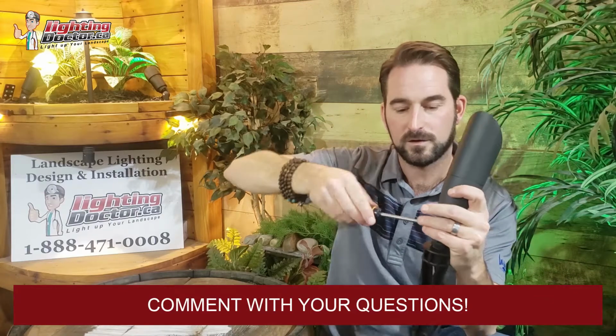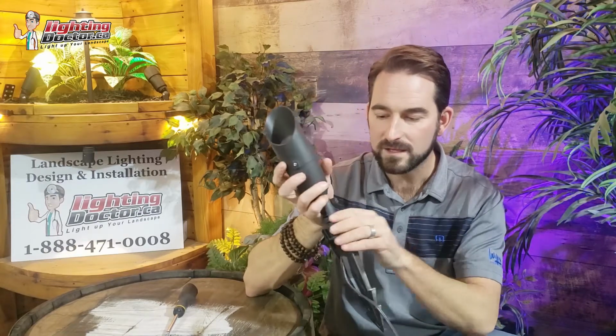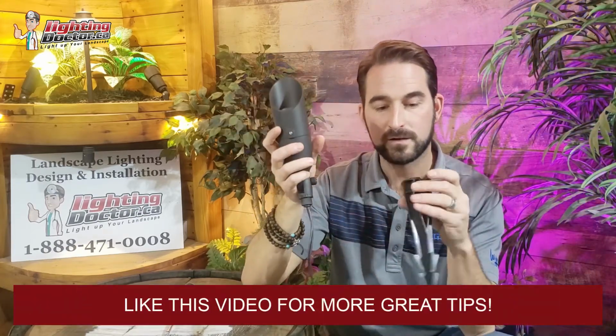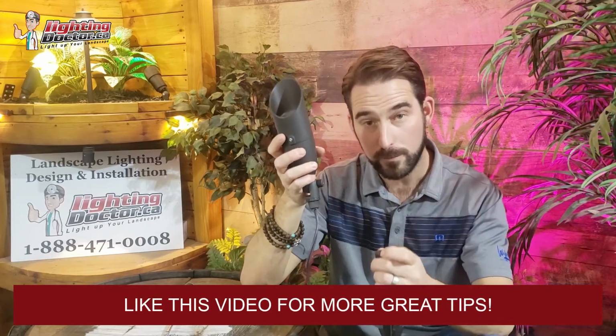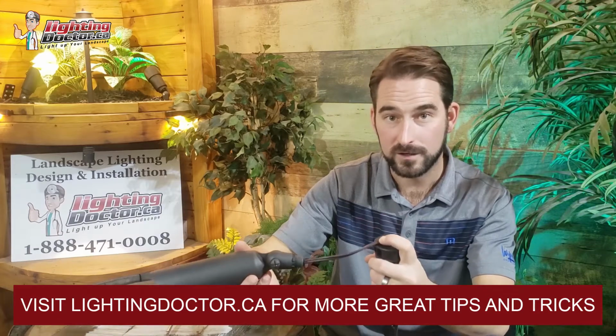The other thing is the ground stake is not quite as durable as with the RS uplight, but it does have the slot there, which we like, so that you can just slide the wire in and out. Why that's important when you're installing it is that instead of some fixtures where you actually have to feed the wire through before you pound it in the ground, this one you can pound in the ground first, and then you can slide your light in and then screw it in. Whereas if you don't have that, what tends to happen is you have to feed it through, and you're trying to pound this in. Well, you've got wire there, and that can very easily be cut, pinched, and then your light is useless after that. So still a fairly good ground stake for what you're getting and for the price.